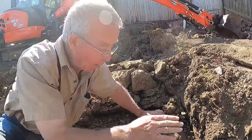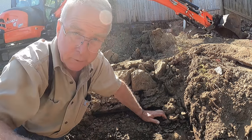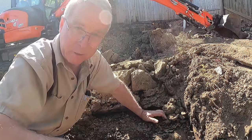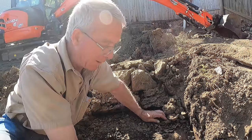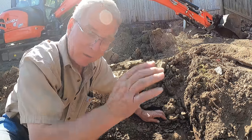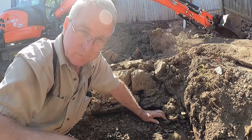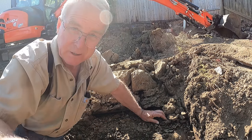What this means is you have to keep this material about 24 inches below the surrounding exposed soil elevation, because 24 inches down there's a fairly uniform moisture content all summer — your building is sitting on something that is not going up and down as it dries and moistens. I don't want to pour a footing 24 inches deep, so I'm going to come up with about 6 inches of compacted structural fill on top of the black mud when I uncover it, which means the black mud is still 24 inches down. Even though the concrete doesn't go the full distance, it's sitting on something predictable. We're going to pull out maybe 5 to 10 more yards of junk, throw it away, come back with good material, and be ready to start forming concrete.